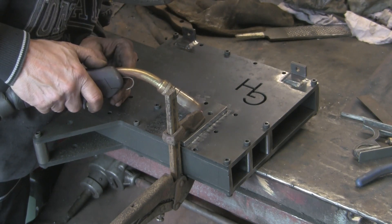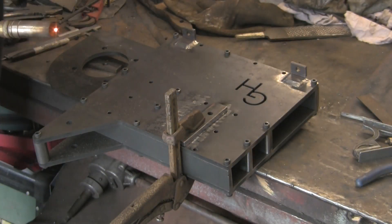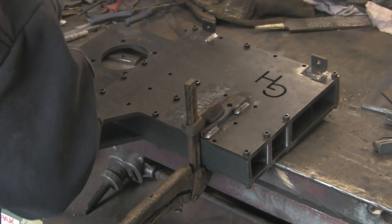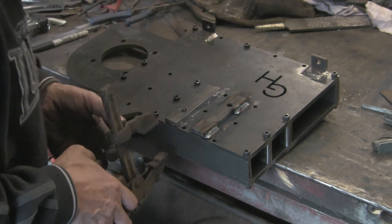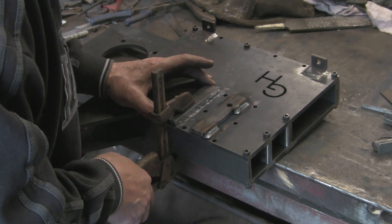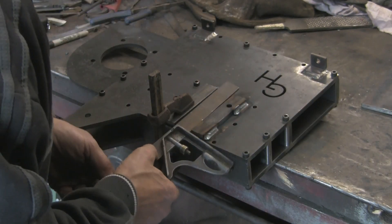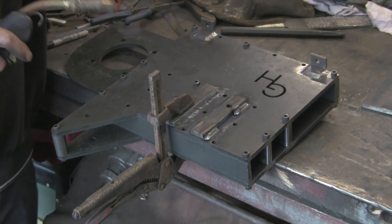I've positioned the first one and I'm going to do exactly as I did before - just four welds, two at the top, two at the bottom. Like I said when I did it the first time, I don't want to put too much heat into it and distort that side plate. I suppose really I should have put some more bolts in there so it can't go anywhere, but it's just a little bit easier to get to the welds if the bolts aren't there. The bolts will pull it all back in fairly tightly if it has distorted any amount.